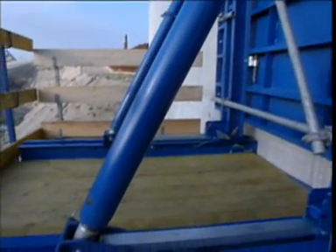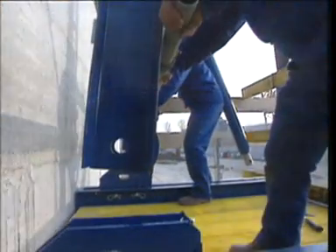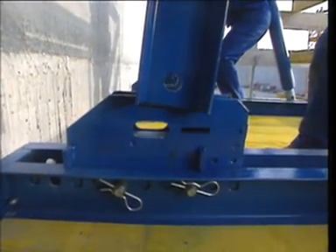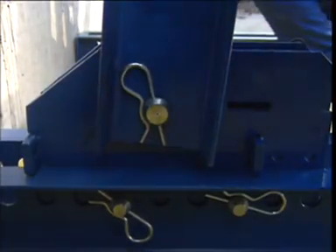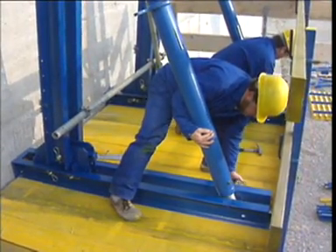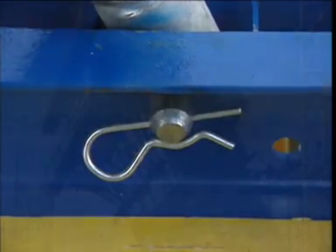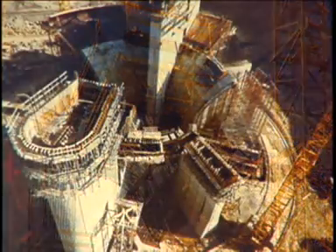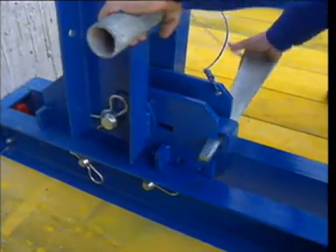The wide platform leaves plenty of room for working in and for retracting the formwork elements. The swivel bearing plate links the vertical walling to the cantilever bracket. In the upper section, the supporting unit, consisting of the vertical walling and the swivel bearing plate, is supplemented by the spindle strut. This supporting construction not only transfers the loads into the previous section, but also means that the formwork element and scaffold unit can be lifted jointly.